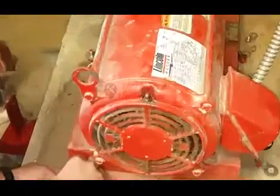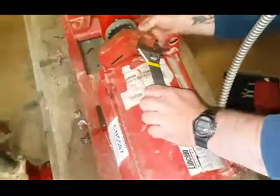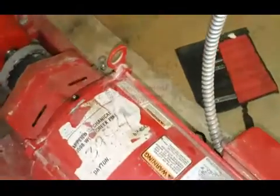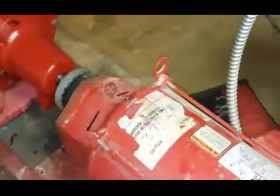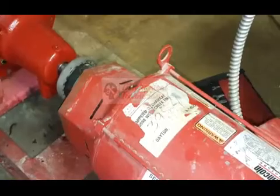Remember — if a motor has some kind of an eyelet, it probably means it's pretty heavy, so this motor does have an eyelet for lifting. You want to verify that the two halves are nice and straight. We're pretty confident this one is good, but sometimes you've got to use a straight edge across there. If you don't get this aligned properly, you'll chew up couplings, so it's critical that you get everything lined up straight and true.